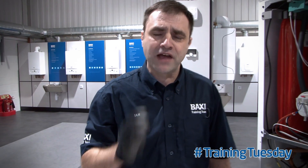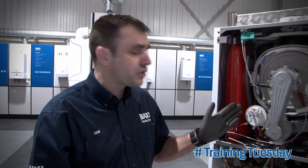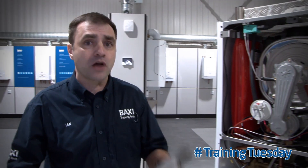This has nothing to do with fan recognition. What it's doing: if there's a flue blockage or if there's a condensate blockage, it will lock the air pressure switch out, preventing the boiler from operating. Now traditionally, if you had a frozen condensate, you'd get an E133 fault.